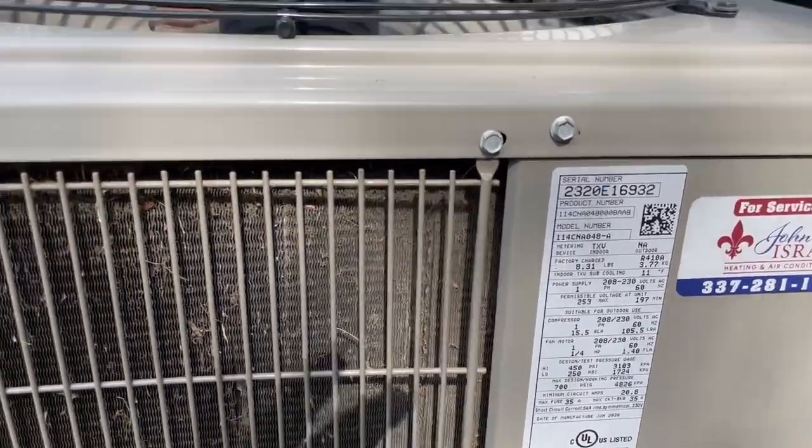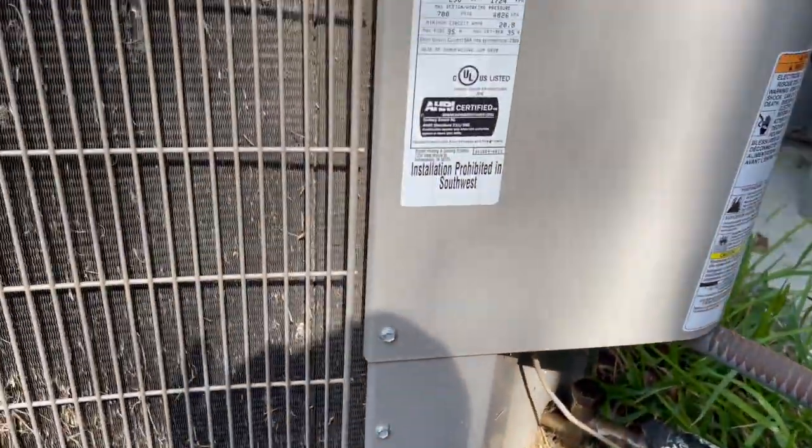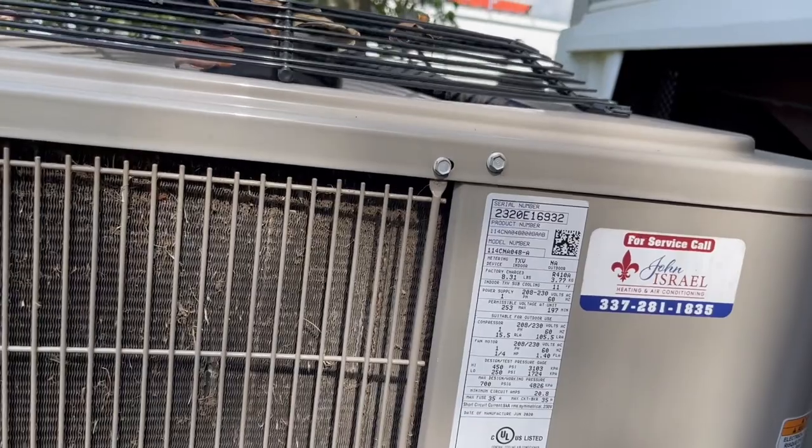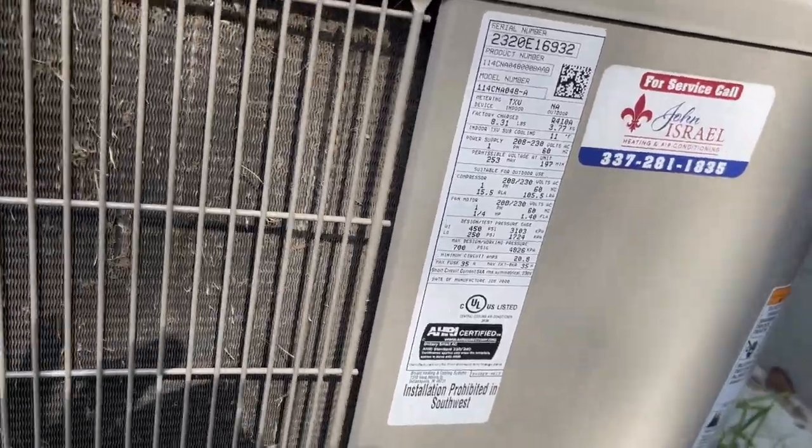I got here and it's running and it's pulling good heat. It's sweating, but she said after we talked it just came on. This thing needs to be cleaned and serviced — it's full of grass. She's going to have to let me come over here next week and do a maintenance on this thing. The condenser coil is covered in grass and has some debris on it too.